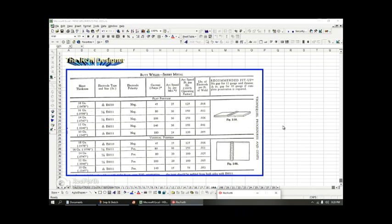They were talking previously in the slide about, remember, 0.10, 0.11 pounds per minute that they were dropping down in the previous slide. And here they're talking about the E6011 at, on average, 0.02 pounds of electrode per foot of weld. So in every foot of weld, the pound of electrode deposited is 0.026. And you could keep that as a rule of thumb. That might be a hard value just to memorize, but everything else is kind of in that range. If you're having a discussion with someone, even at 10 gauge material, it's 0.055 pounds of electrode per foot of weld.